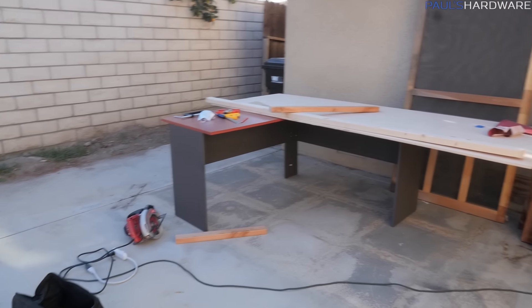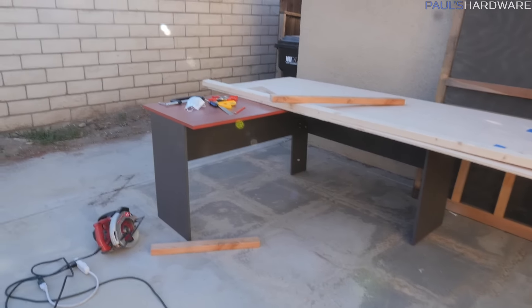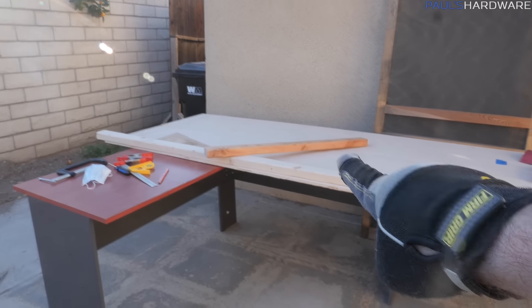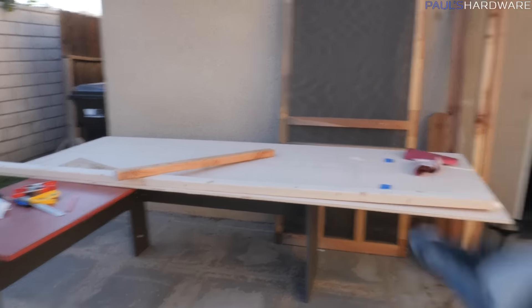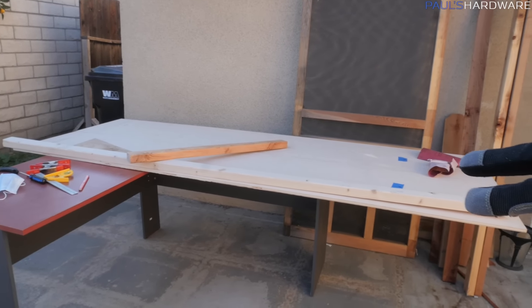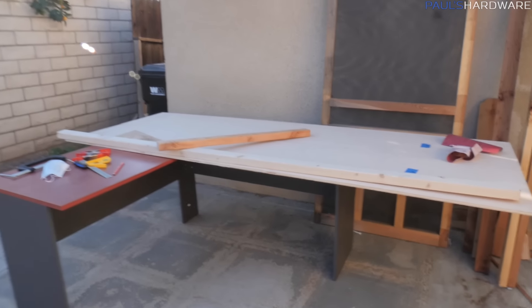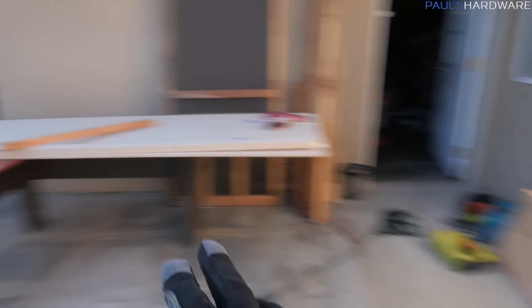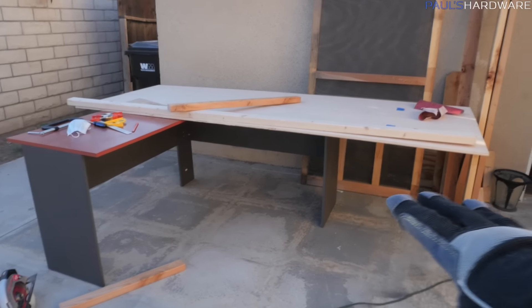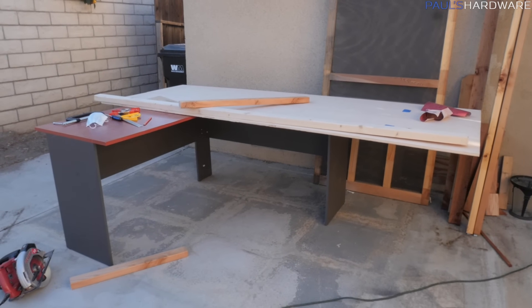Out here behind the garage I have set up my old table — that one right there, it's like 15 or 20 years old, but still alive and kicking. I need to cut three more pieces to that width, plus three shelves and one top piece — the top piece being a little bit wider. These two pieces with birch on the front are going to be the actual doors. I'm going to router a little beveled edge on the sides and do some sanding. I also need to notch the two side pieces at the bottom where they go up against the garage door. Hopefully I'll get everything cut out here before the sun goes down and then assemble everything inside.